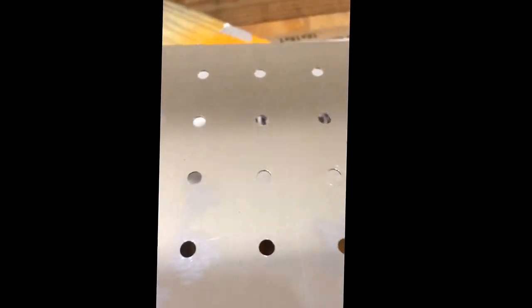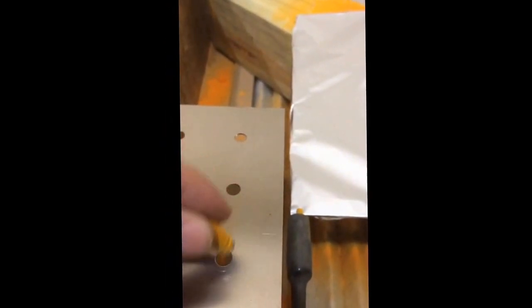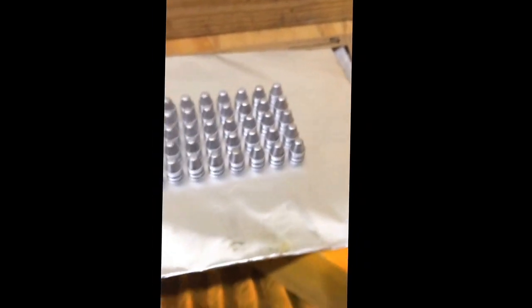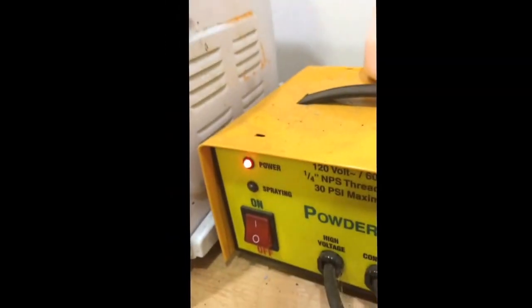I bring them over here to a nonstick aluminum foil surface to keep the powder coat from sticking. I've made these little holes set for 30 caliber - that's why the end there is bare - the aluminum foil fits right in there and they sit up nice and straight. I don't have to worry about them tipping over when I'm baking them. The gas check goes over that so I'm not worried about it. This is the 185 Lee mold semi-wad cutter, 45 caliber.